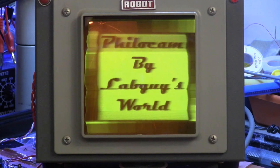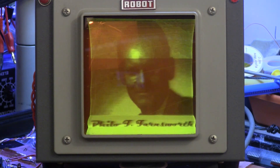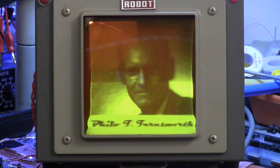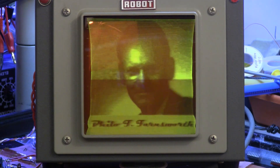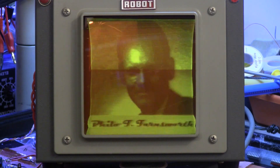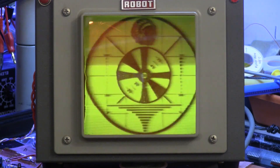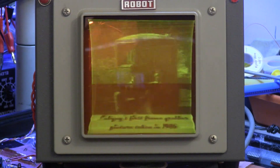This is the PhiloCam startup card that will be the logo for this system. Here's a picture of Philo Farnsworth — note that the grayscale is much improved over the oscilloscope. This monitor and the other camera were designed to operate without gamma correction. The output of my system is linear, and this monitor accepts a linear input signal and produces a reasonably good output. There's our circular test pattern showing that the scan geometry is pretty good — not perfect, but pretty good. The Laurel and Hardy picture is a little easier to see, still a bit dark, but that's just the way it is.